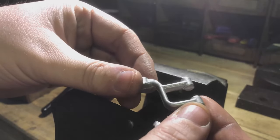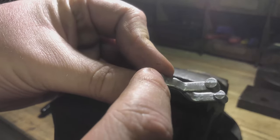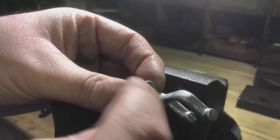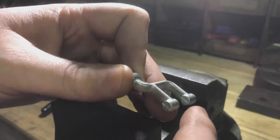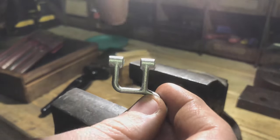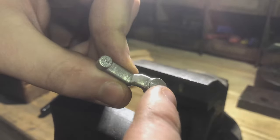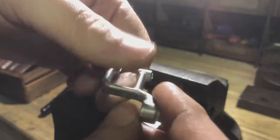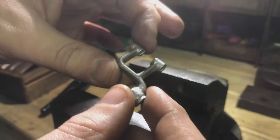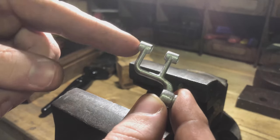Just like that, all the flashing has been removed. Contours have been brought to size and I've got rid of the mismatched step that there was in the casting. I don't need to worry about these parting lines here because these faces all need to be machined. Fixturing this is going to be interesting — I'll have to use the side of an end mill to do those slots. Let's go over to the little mill and look at how I'm going to fix this up and cut it.